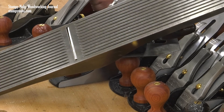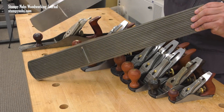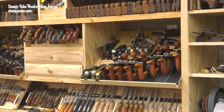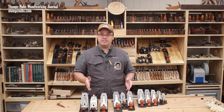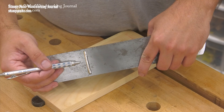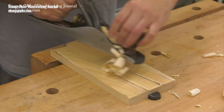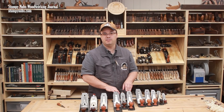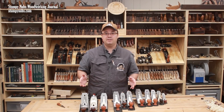Stanley made corrugated versions of many of their planes with the claim that the grooves reduced friction and made them easier to push. It was mostly a sales gimmick to convince folks they needed to buy another set of planes. Now you might look at the wall that's usually behind me and say the marketing worked, because I have two sets of bench planes — but there are other reasons for that. For one thing, different planes may be set up for different uses. For example, a number 5 may be used with a straight iron for most work, but a heavily cambered iron is useful for aggressive planing. So multiple irons could be very useful — but do you know what's even more useful? Multiple planes. That's one reason why I have more than one of many bench planes. Some have different irons with different grinds for different purposes. Is this necessary? Not at all.